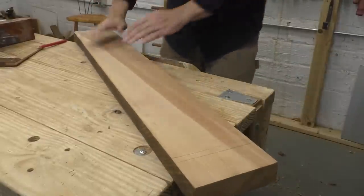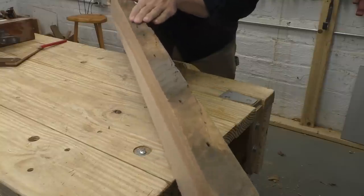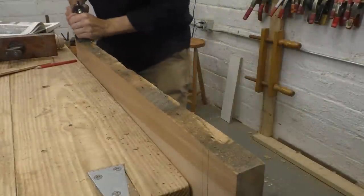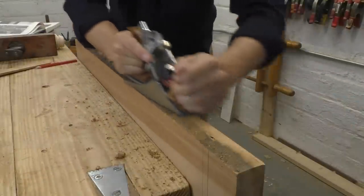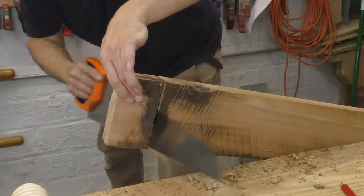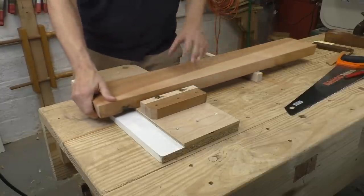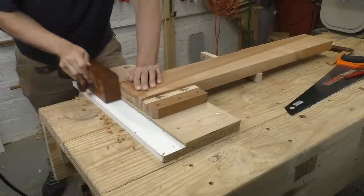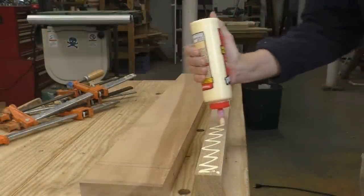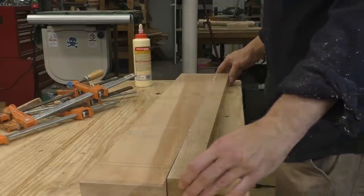All the books agree that these vises were big and beefy, so this project demands a thick hardwood jaw. I'm using this piece of reclaimed tulip wood — it's a heavy and dense species. Up until a few years ago, this piece was supporting heavy machinery as part of a factory floor, so it's perfect for this project. I use an aggressive saw to quickly get the piece down to size, but that leaves a rough surface. Luckily, my advanced shooting board is designed to handle big, long timbers, and you can use it with pretty much any plane. I've got plans and a video if you'd like to build one. As big as it is, this plank is still too narrow to handle these enormous screws, so I add a strip of white oak along the bottom and leave it to dry.